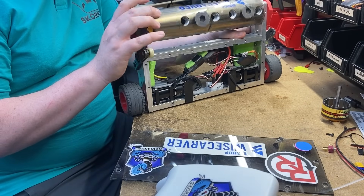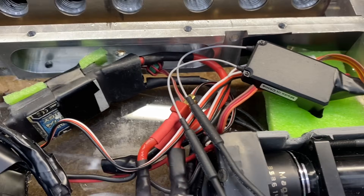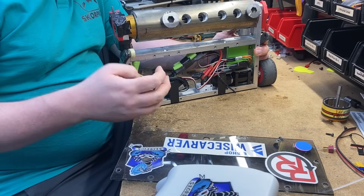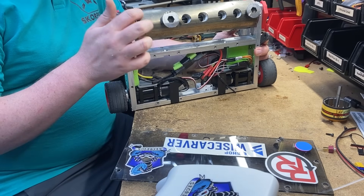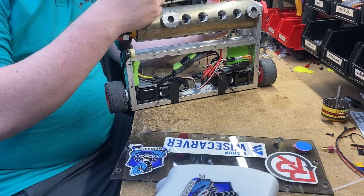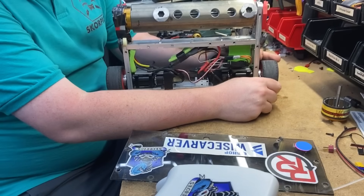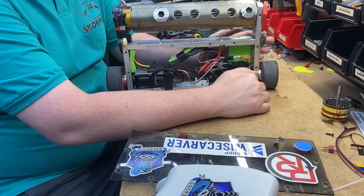Each match, the stator and the hub motor took damage. After the Minotaur fight, the hub motor is still working, but that fight was pretty short. I'm going to put the motor inside the robot — it took a long time to service the hub motor, and by doing a motor and belt instead, it gets the motor away from hits and impacts. I did lose some magnets after Nightcrawler. So the motor needs to move inside, I need to switch to four wheels, shorten up the drum to get some weight out. I might even hollow the inside to reduce it to four pounds. The battery can be half its size, and switching to Tegris will get some weight back from the aluminum.